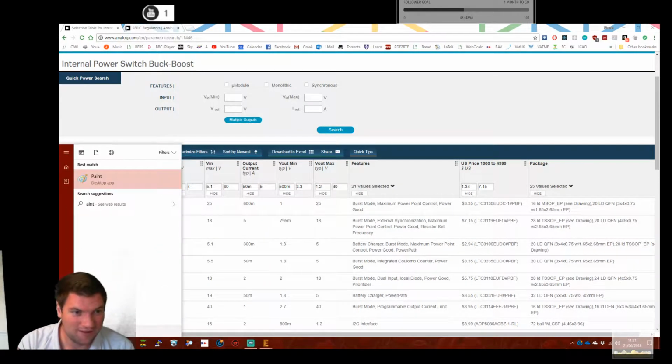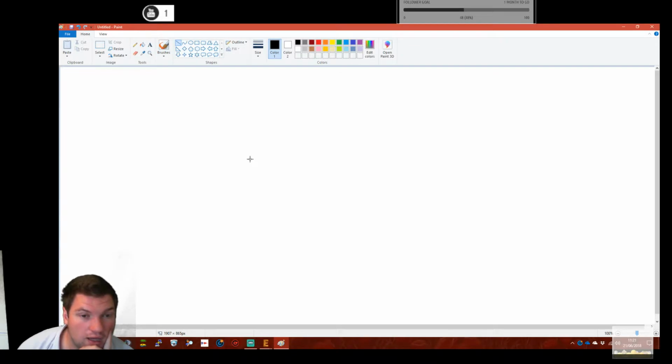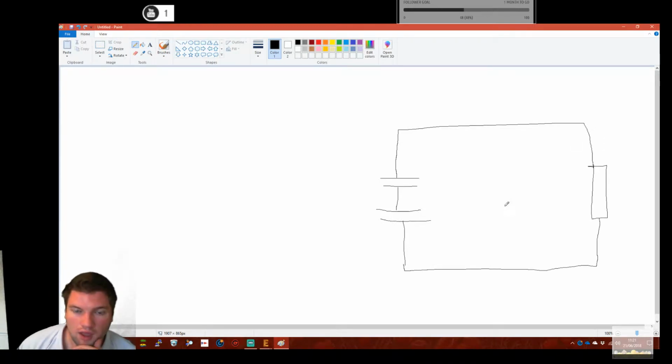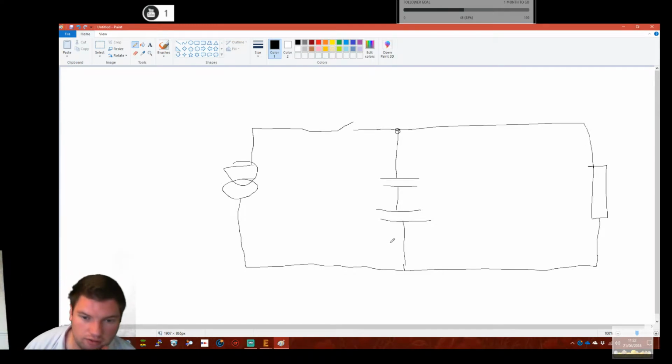You know what I'm going to do, don't you? Here we go. Right. Eagle, why don't I do it in Eagle? Anyway, so if we've got our pencil, we've got our cap here, and so we've got two of them in series, right? And these go off to our load. Right, we'll just draw a resistor. Okay, and then we're going to have some sort of charge circuit. Let's put a switch on here. Hello, Pippa. Yeah, meow. And let's just put some sort of current source in here. So this is just a really, really crude, let's charge our supercap.